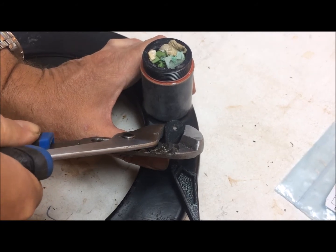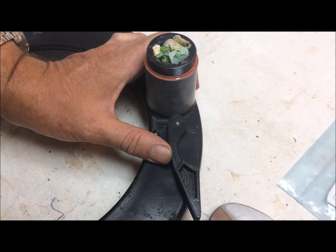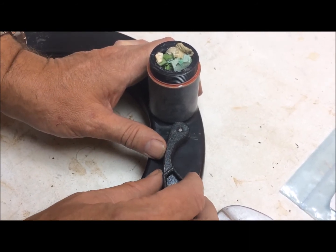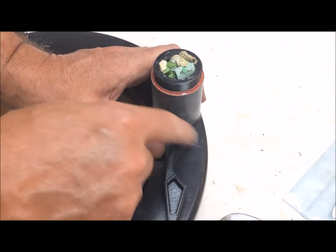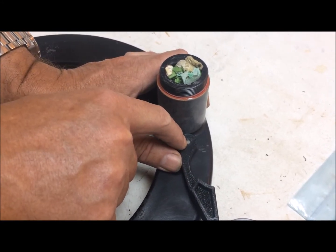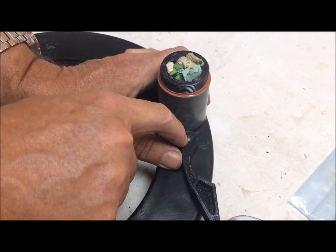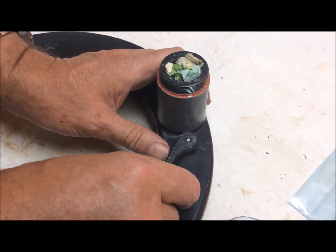You may need to adjust your pliers several times. If it's too hard, pull the pin out, move it, turn it at a different angle, and readjust the hole. If you press too hard, you'll collapse and break the roll pin. If it's really too hard, take the entire assembly apart, use a 1/16th inch drill bit, and drill through the shaft — enlarging the hole from 1.5mm to 1/16th of an inch. That should make things a lot easier, though it usually requires you to disassemble the control helm wheel.